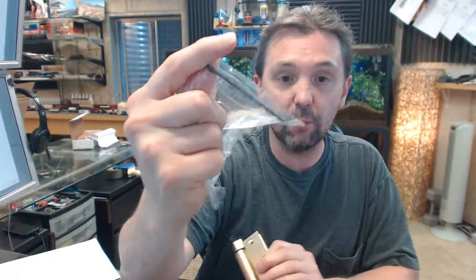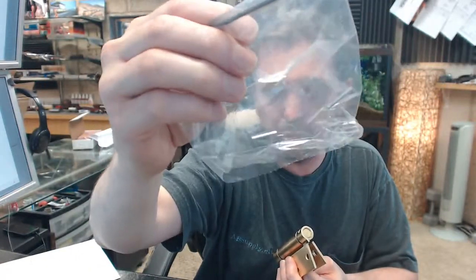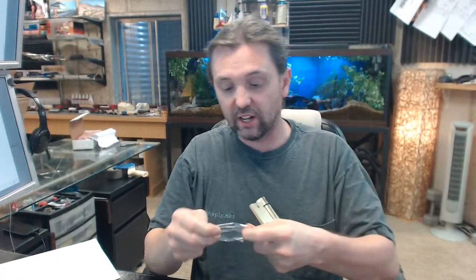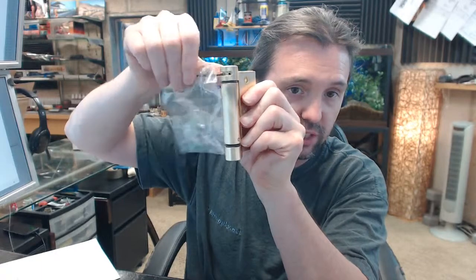How to set the tension? Every order will come with a tension rod that's a black piece of steel, and a tension pin, which is a silver piece of steel that you see right there. Now this order happens to have 2 hinges on it, so the client's got 2 tension pins. Well, with that tension collar pointed towards the top, insert the tension rod into one of those holes and turn it clockwise. And as you do so, you reveal new additional holes, and it's into one of those new holes that you'll insert that tension pin. Up to 3 holes is what Bommer recommends for setting the tension. Go beyond that and you run the risk of contorting that spring, and of course it can break, and the hinges are irreparable at that point.